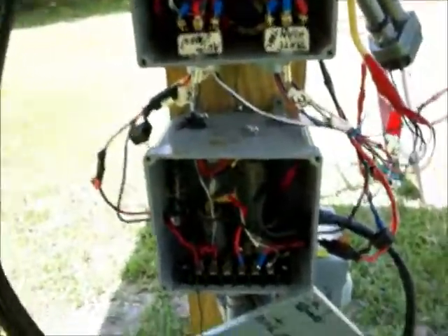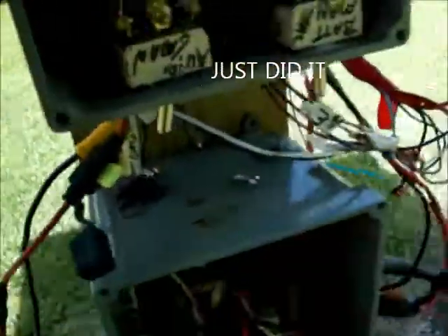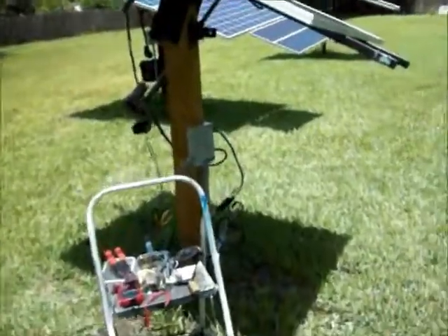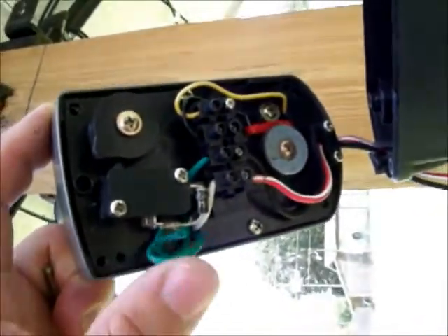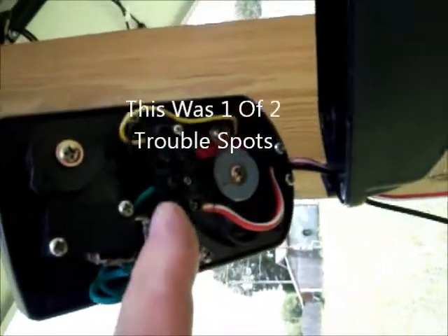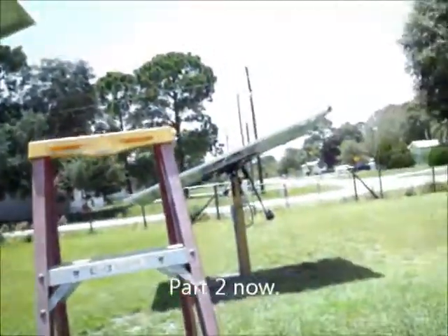This thing has been driving me nuts. You can see I've got quite a rat's nest of wires, but they're all labeled. I've been popping fuses randomly for no apparent reason. As it turns out, the problem was inside this actuator over here, which I adjusted to go off at a different time. A wire was loose, causing it to short out and blow the fuses. I've just corrected that and added some more wire, and I need them all straight so I can do a proper test.